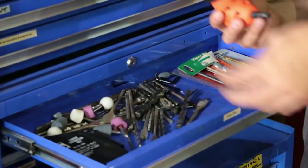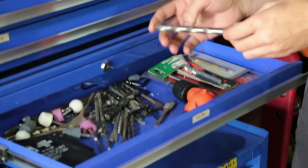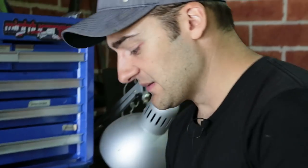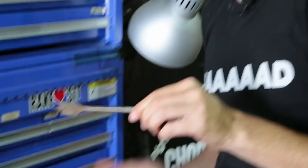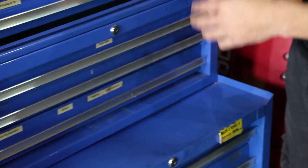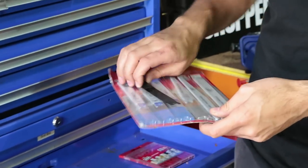Next we have drill bits. This is the right angle drill we used for our roll bar install. There are also lots of normal high speed steel drill bits — if you get one set of quite good quality, they will last you for ages, and you can also sharpen them. Spade bits are great but only really good for wood. Hole saws also fall into this category. You've got screw extractors for stuff that breaks, and hacksaw and demosaw blades, which are handy for chopping up things like front mount pipes or fabricating your own parts.